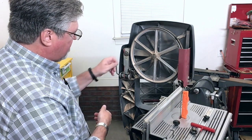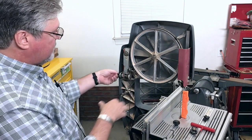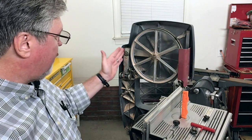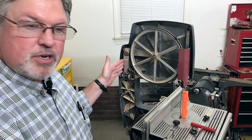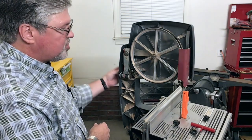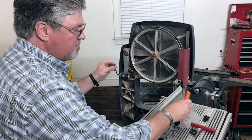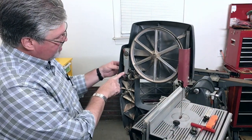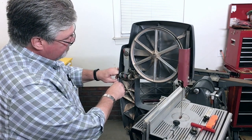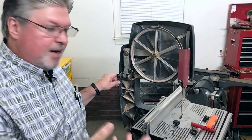When you get the saw brand new, or if you ever need to adjust it, what they tell you to do is to take the tension off. Right now the blade is lowering - there's no tension here. Loosening that single screw, you align that steel plate with the edge of the red spring, so none of that spring should be showing. Then when you go to tension this - it uses the same 5/32 hex wrench or Allen wrench that we use for all the changeover on the machine - you take this up until that red line disappears right behind the tension you want to set it for. That is at the quarter inch mark. With the Easy Tension, it went to actually the 3/8 inch mark, which is not at all bad - just a little more tension.